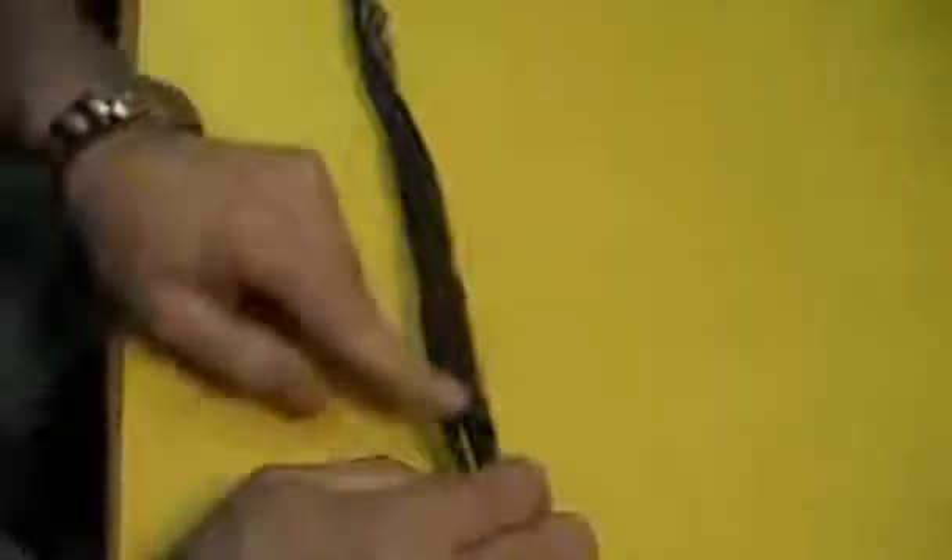The other key thing to keep in mind is that this area on this edge is double thick at the overlap flap. If you have a chafe problem, it's desirable to orient the tubing before you shrink it so that this double thick area faces your chafe problem. And that looks like a pretty good assembly.